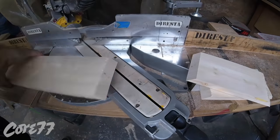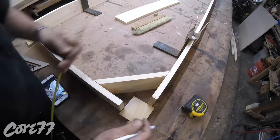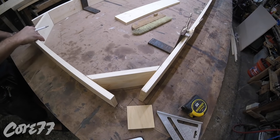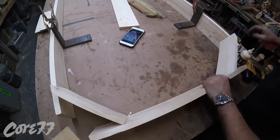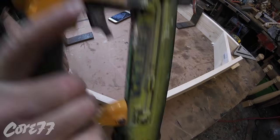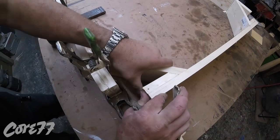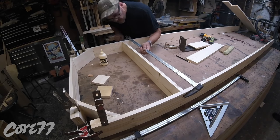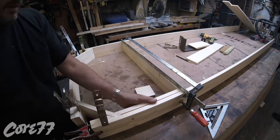To do repetitive cuts I draw lines on my chop saw — I do that a lot. I'm just feeling and making sure that we're in the right spot; I had to adjust my mark. Once I got my mark I made sure it was the same everywhere. I put that in and make sure the leg, represented by those two squares, has the right proportions — I want the legs to be proud of the apron by about a half inch on both sides. I'm just nailing it together. You might think that isn't strong enough, but I came up with this idea to avoid having to do dados by just layering everywhere. Everything gets double layered, and as the layers are added separately they start to interlock. So this whole entire table frame is just glued together for the most part, aside from those few tack nails.